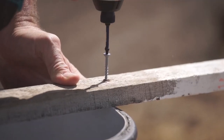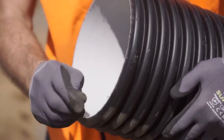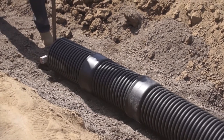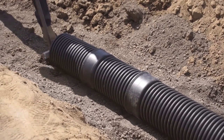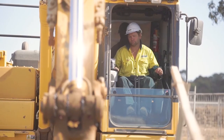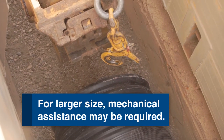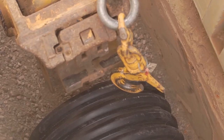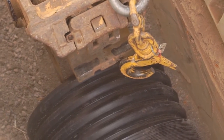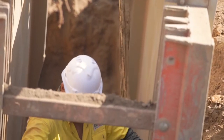Additionally, you can screw a piece of timber across the face to assist with force. A rubber ring is not to be used on the insertion stub. Push the pipe home until the spigot end comes into contact with the inner wall of the socket. A leverage tool such as a crowbar is generally sufficient for StormPro pipes up to 375mm nominal diameter. Where applying a jointing force is not practical, consideration should be given to the use of come-along or winch and rope devices. Other mechanical methods may also be used, such as pushing the pipe together with a bucket head for larger sizes. However, caution should be taken for all methods to ensure the socket end is protected by using a short cut-off stub insert.